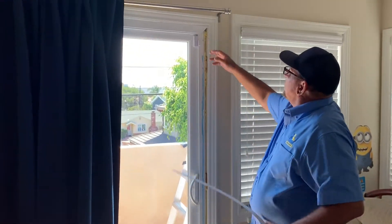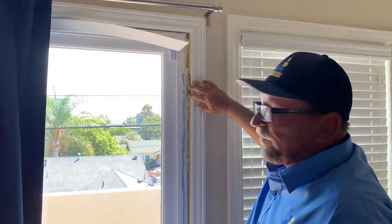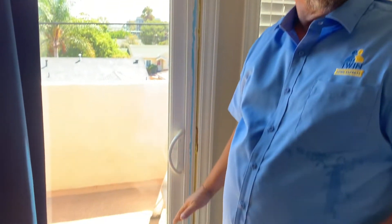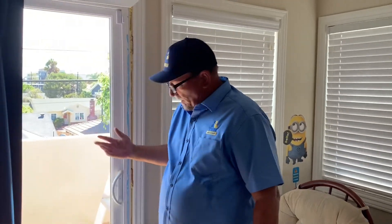Let's go inside to the interior and look at how this door was installed. What we have here is a classic retrofit-installed door, which is not the right installation for this home. There was an existing wood door and wood threshold that was left in place, and the contractor put in a retrofit block-frame door with no flange — no way to seal against water. This is where the water intrusion is coming from.